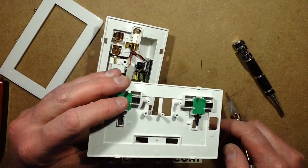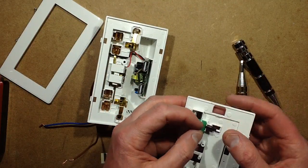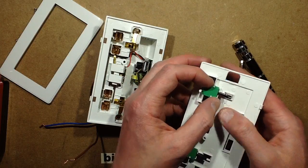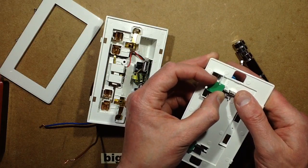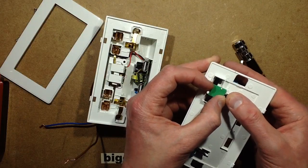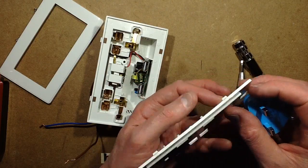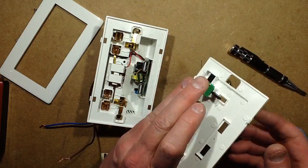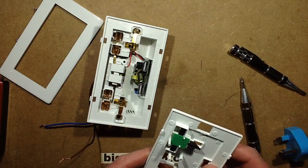Here's the shuttering system we use in the UK. When you put a plug in, the earth pin goes in first and it pushes a shutter down that slides out of the way of the other pins. That basically stops kids from poking things into live connections. Someone thought it was a good idea, and quite frankly it was.